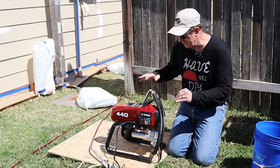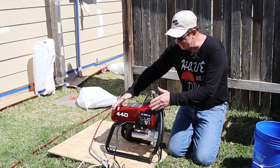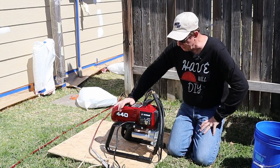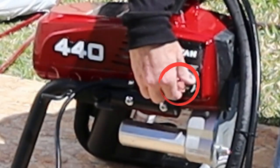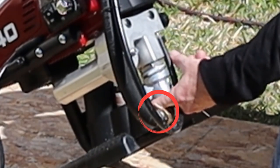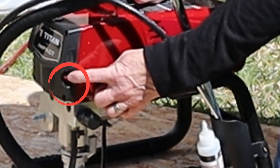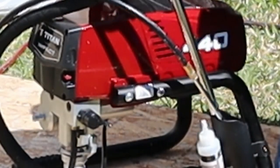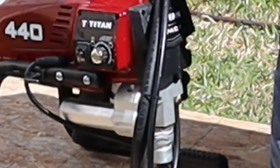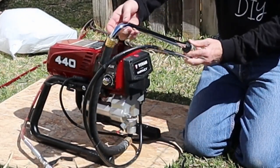Let's do a quick overview of the sprayer. They're all pretty much the same — same parts, they all spray paint. While I'm using a Titan 440, it might be slightly different for a Graco or any other kind, but not much. All of them have an on/off button, some way to adjust the pressure, a button to release the ball valve, a self-oiling button, a switch for prime or spray, and a prime tube to suck the paint up.